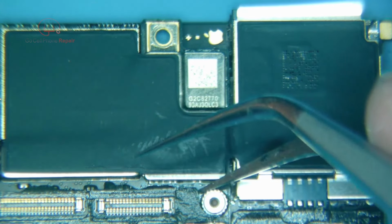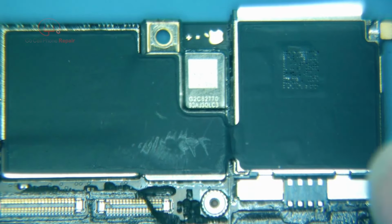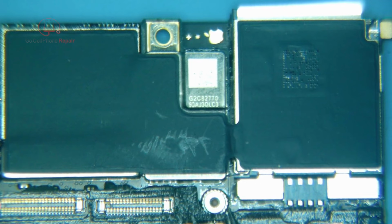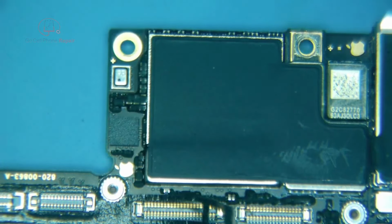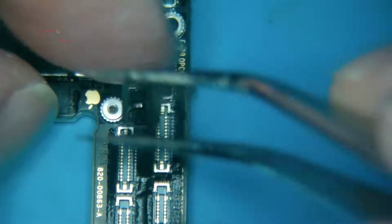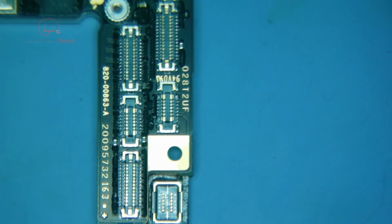And to do that, I'm going to take off these little foam stickers because they like to melt when we heat up the board. We're going to have to put this on a platform, warm it up, and pull this thing apart. And as long as all of the contacts between the two layers are in good shape, we might not have to reball and replace the existing solder, because usually with this particular model that is not necessary, although there are exceptions of course, but with any luck we can save a little bit of time by not having to do that.